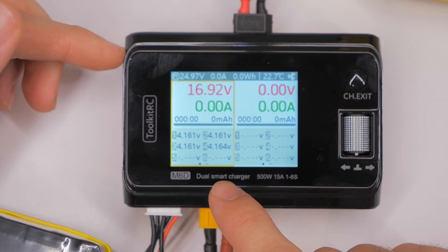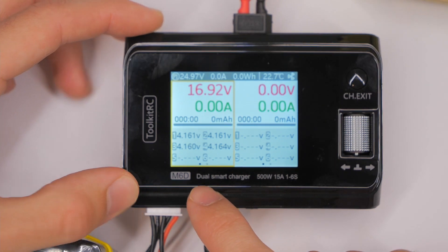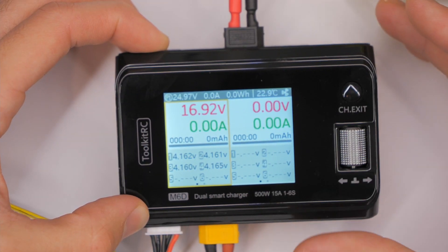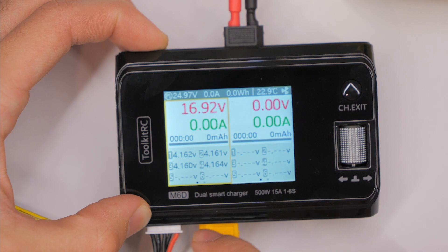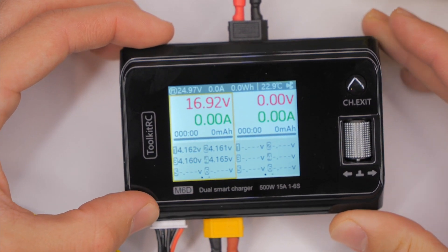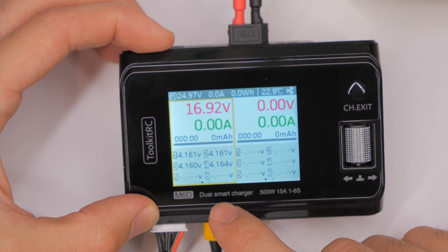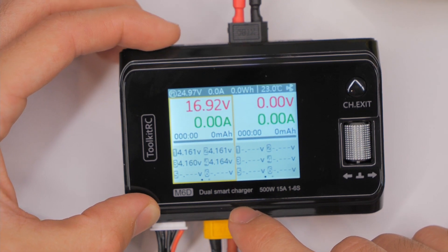Here's the thing: the voltages are not really off by that much, so we don't actually have a voltage problem. I've checked this with a multimeter, actually checking the cell voltage. I've also calibrated the voltages and it's still not working. As far as I can tell, it's just a glitch — there's no reason it should not charge because there's not actually a big imbalance. A big imbalance would be off by a significant amount, but it's only off by a few thousandths of a volt, which is not enough to matter.